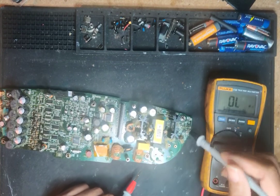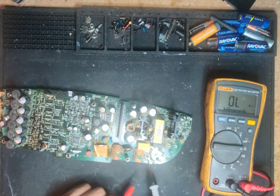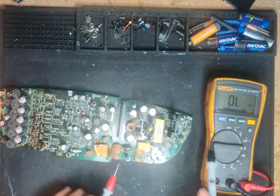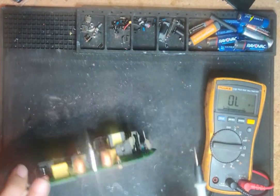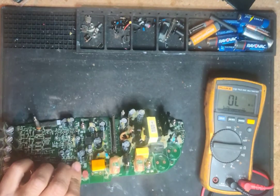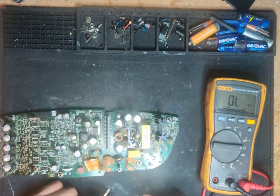I thought the 10-ohm feedback resistor was the problem — I tested it and it was fine on this board — but it just wasn't getting any voltage to begin with. I was never looking over at the startup resistor area because I assumed the problem would be near the chip. I don't know how I thought it was going to get its voltage over there when it starts from over here. It's a multi-layer board — at least three layers — and you can't see the trace from either side. No schematics; you just don't know where things connect.